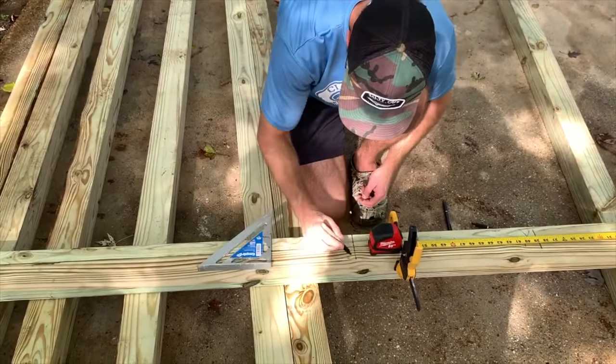After trimming out the outside corners, we're gonna move on and install trim around the door's rough opening. And just like the outside corners, we're using 3.5-inch pieces of trim that we pre-painted. And we're gonna install it so that the top of the piece of trim is completely flush with the top of the door's rough opening, as you can see here. After we get that one installed, we're gonna go ahead and move over and install the one on the other side the exact same way.